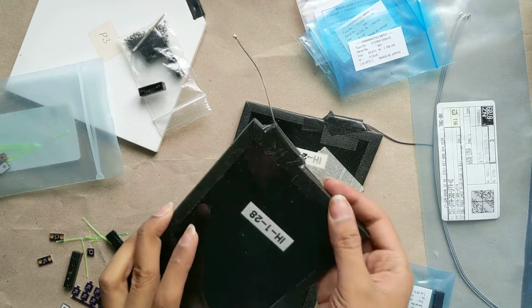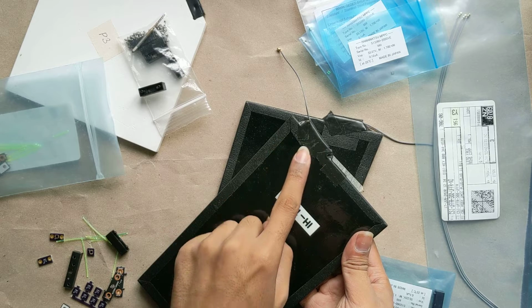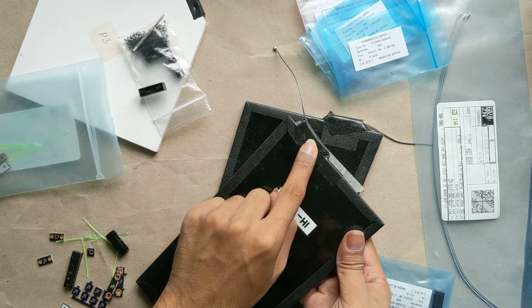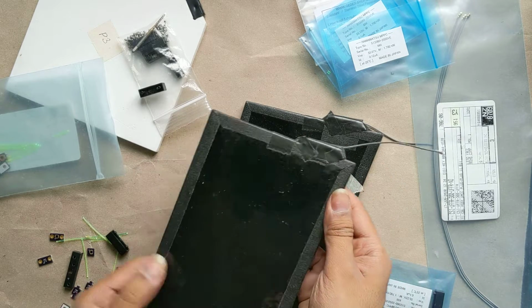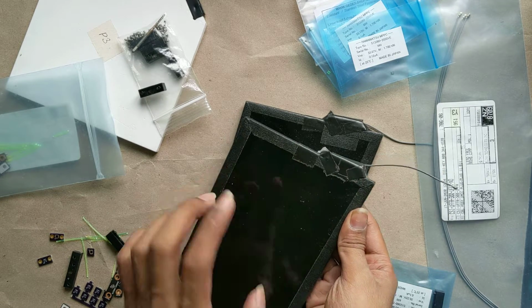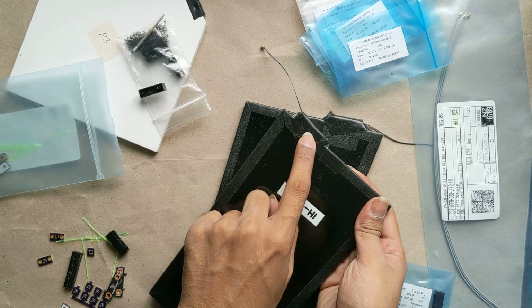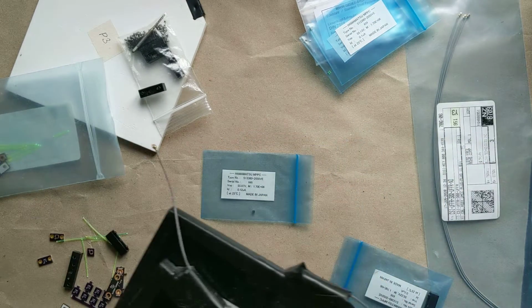So the next part is sensing and sensing assemblies. The fiber optic brings the light from the scintillator panel into one point, and therefore we need to read these single photon counts, somewhere between 10 to 30 photons that end up near the sensor. The way we can do that is using an MPPC, which is a single photon counter.